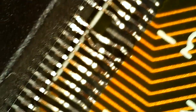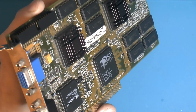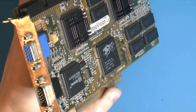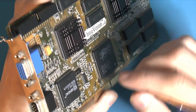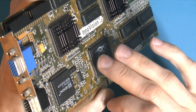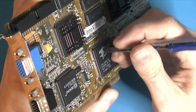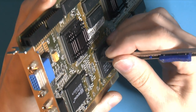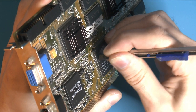So that's the next job too. I actually have to dig out in the chip here to do that. So the next step would be to actually carve out a piece of the epoxy capsule of the chip, so I can actually get to what's left of the pin, because they are basically traces going to the chip. Some people are using Dremels. I've used a knife and it works quite fine. It takes a few minutes, but you basically have to dig in here.